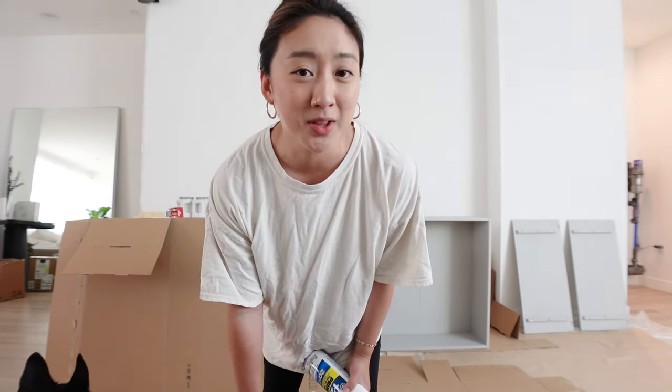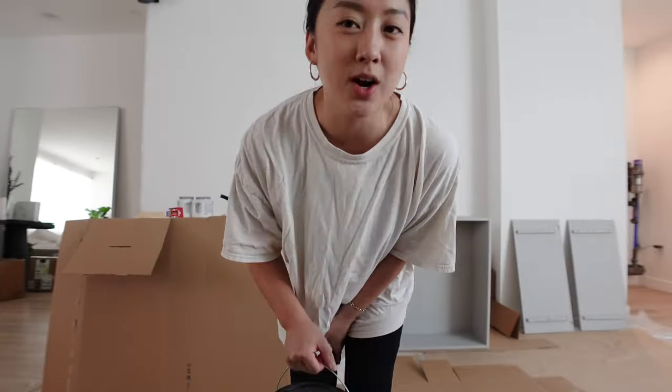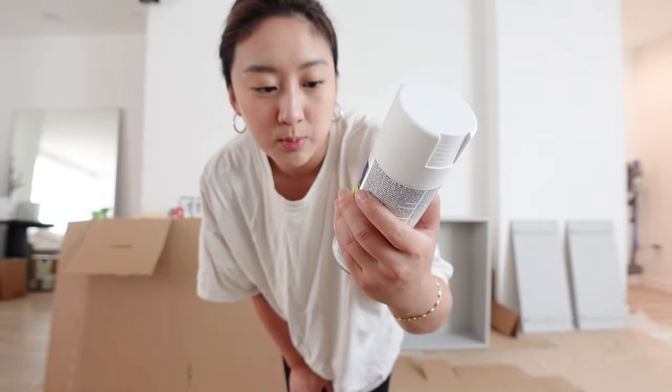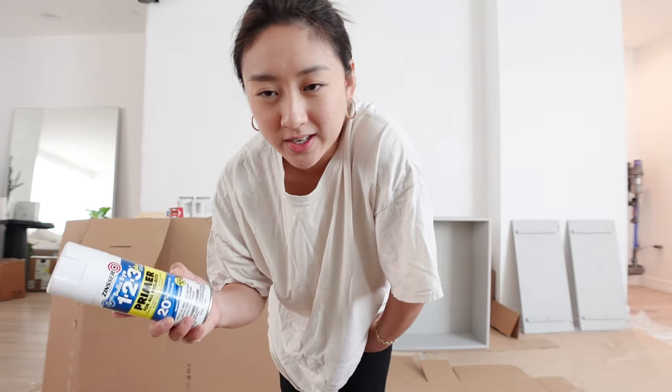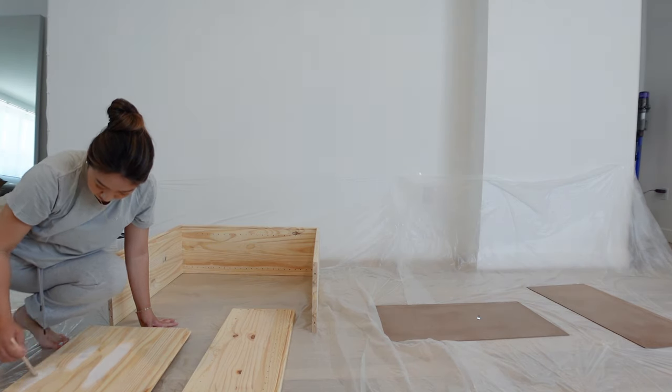I learned a lot about painting this past month. This is the best stuff for painting furniture — it's the BIN primer, the one everybody talks about. It's a shellac-based primer so it has a smell that I honestly don't mind. This is the same brand Zinsser — the 1-2-3 primer, which is a water-based primer, easy to wash off with plain water. The shellac-based one is really messy if you get it anywhere. And take it from me: do not use aerosol primer indoors — it's really messy and extra smelly coming from an aerosol can.